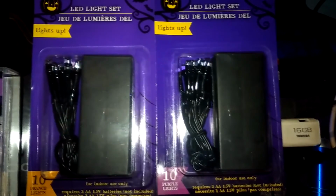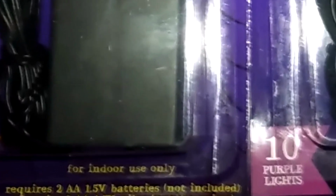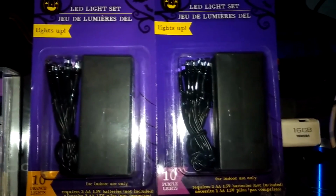One thing to note is the heat shrink at the bottom is not weather tight. It is very easy for water and humidity to get in, and when you're running a DC current like a battery, slight moisture can present corrosion problems, so these would not be good for outdoor use. However, for indoor use, they run cool, they have a pleasant color, and like I said, they're being driven below their maximum tolerance, so they should last a good long while.